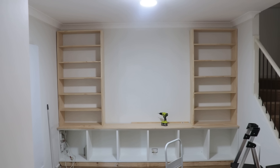There are some gaps in the woodwork, and they will require some timber moulding. First and foremost though, let's fix the bottom. The 2x4s aren't exactly the nicest things to look at, so they're going to be covered by some DAR pine. The end profile needs to fit the existing moulding pattern, so I cut out a cardboard template to trace onto the wood, and then I can now cut that out with a coping saw.